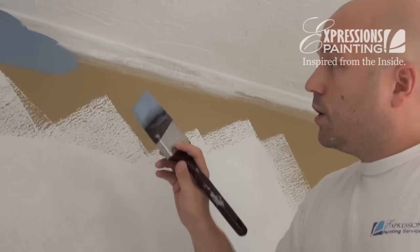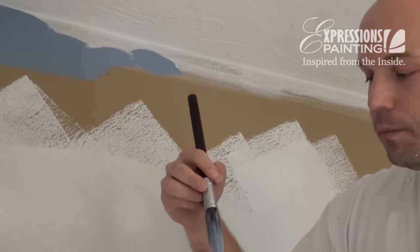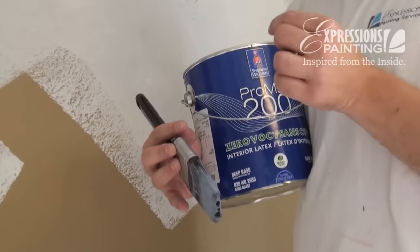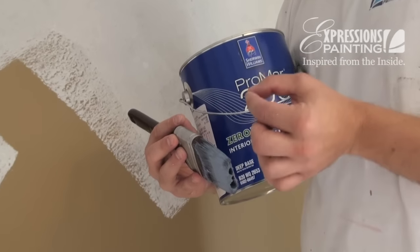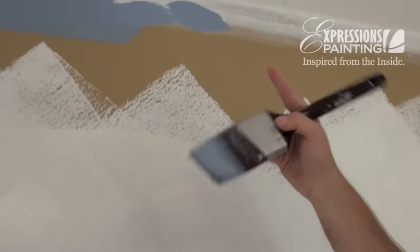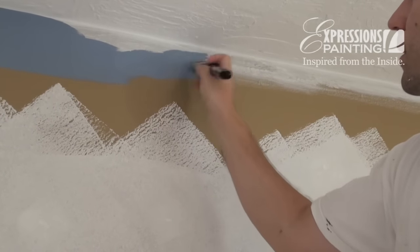The first thing is you want to spread the paint roughly on the wall. But the main thing is you want to remove the paint that's over the top of the bristles right here. Those are the bristles that are going to be giving you that straight line. You really want to work the bristles, or let the bristles work themselves into the corner. But if you have too much paint over them, they'll end up touching the ceiling. So you do this — you remove the excess paint from the top.